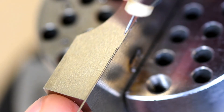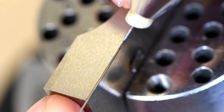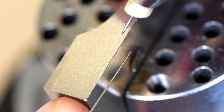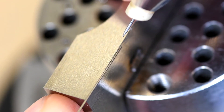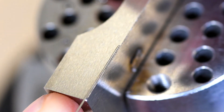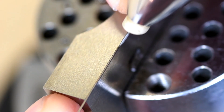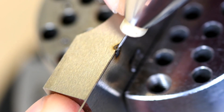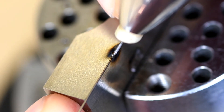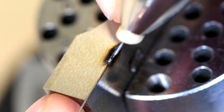The technique for welding an edge is very similar to welding a flat surface. You want to lay the wire flat against that edge and bring the electrode to the front of the wire. The only difference is there's a little less material to help keep that wire still, so when doing an edge, you really need to have a steady hand. I'm on my edge preset, and this is 15 thousandths diameter wire. I'm keeping the wire steady and just moving the electrode down the line, giving me these nice overlaps.